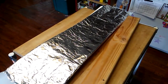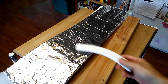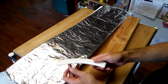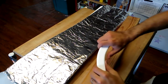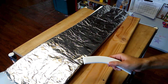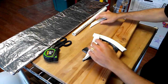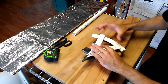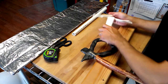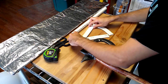I'm just going to run this under some cold water. By the way, if you were planning on making a shamshir or a curved dagger or any such thing, that's the same way you do it — you just curve it before you flatten it, and then flatten it in the curved state. That's really all there is to it. When it's semi-plastic, you can apply pressure and deform it a little bit. So here's the blade — not bad, huh? Very good. Let's get about to actually putting these things together now in the garage.